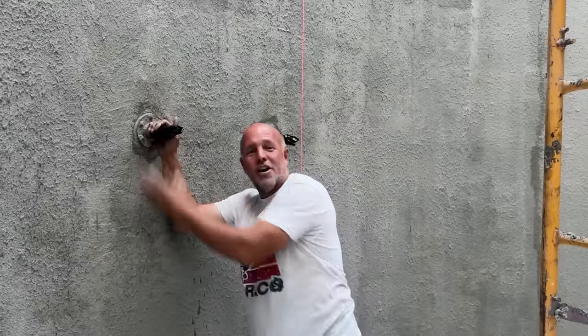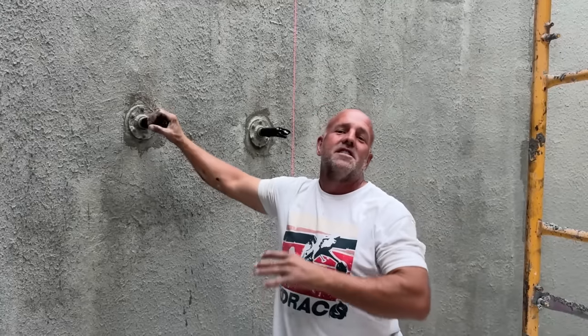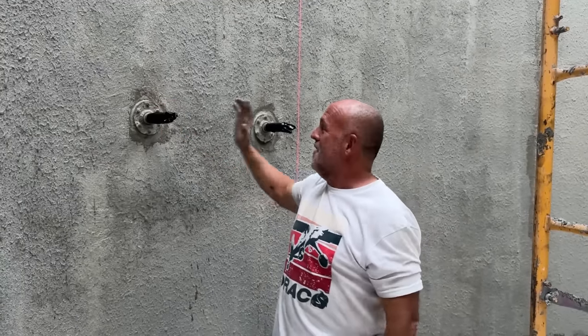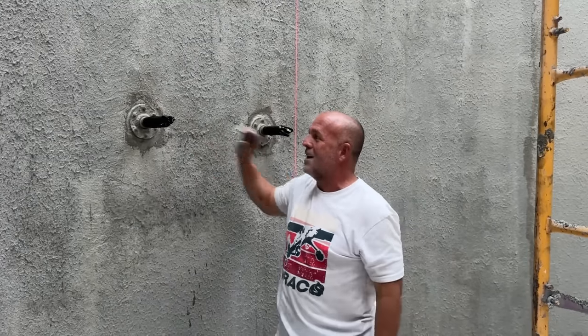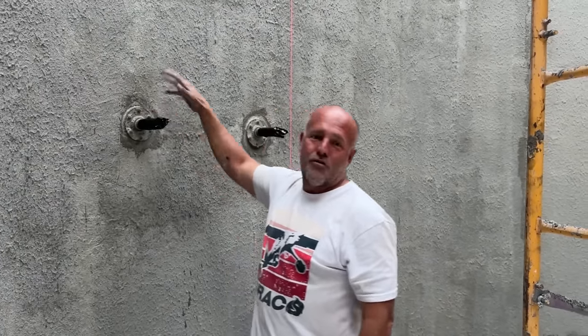So lots of little engineering things. You may think that you could just put it on and weld it. You can't stop Mother Nature. Physics are physics. You just have to work with it. If I just put this on and welded it and got a massive thermal grow in the pipe, I would start cracking fittings, potentially cause water to get inbound through the bolt lines. It could cause all kinds of problems, or just actually the way I've got it bolted, more than likely the ladder would just kind of S-bend, which would look like crap as well.